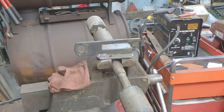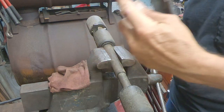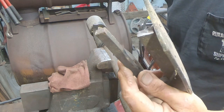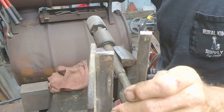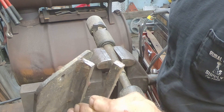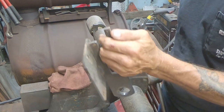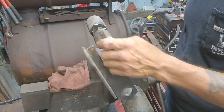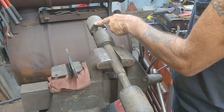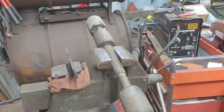What's happening gang. We've got a broken roller here — as you can see, it's sheared. It's a clean shear but it has an old crack in it. What I'm going to do is bevel either side, and same thing down here, bevel either side, and we'll fire up the welder and get her welded up.